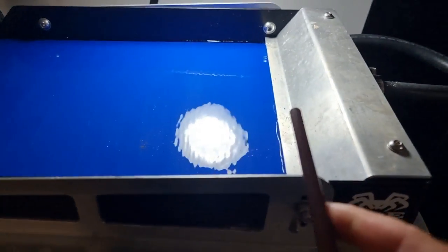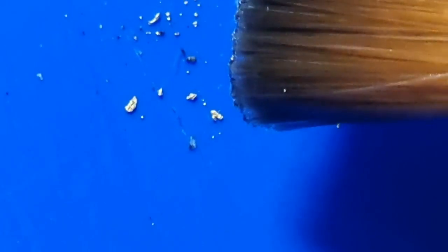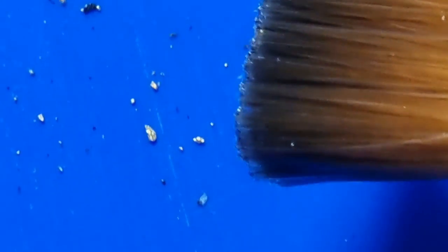Remember, I have adjusted the pitch to move the cassiterite off and keep the majority of the gold at the top. I have fiddled with these settings again and again to get the maximum return I can with the material I'm running — and that's how much gold I was losing. These little pieces here are the pieces you want to be recovering, and that's absolutely right, but what blows me away are these little round bits. Those little round bits are the ones you don't even see escape out of your miller table. You would never see them in amongst your concentrates. And I'm going to show you what I mean by they roll — push it all up, see them roll forward, and then they stop right on the scratches created by the sandpaper. That rolling is why you lose them. If I didn't have scratches there they would just roll off the end, but they stop in the same spot every time.